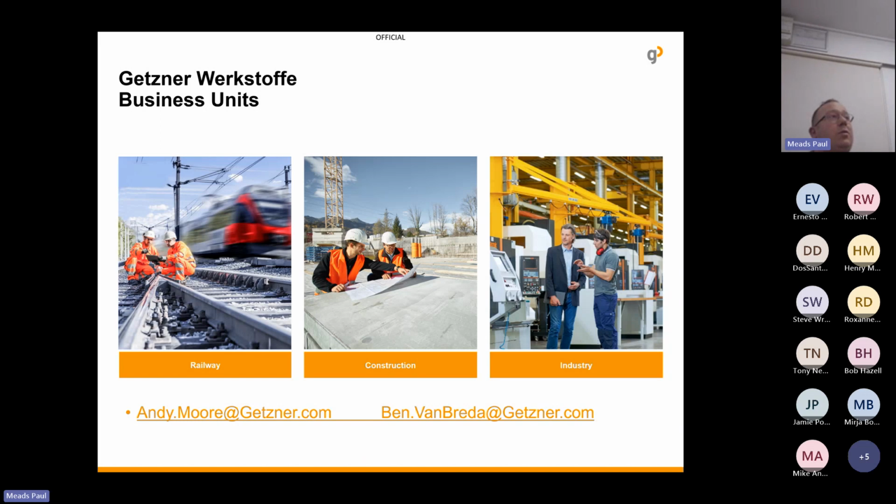As part of one of our strategies around predict and prevent, we're rolling out remote condition monitors across S&C units across the route, and we're talking about the business space, what we're going to do in the future in CP7. And if it hasn't already been done, I want to ask: has there been anywhere where void monitoring or accelerometers have been placed on S&C units in use on live railway and track, the comparative between before and after a renewal with flat?